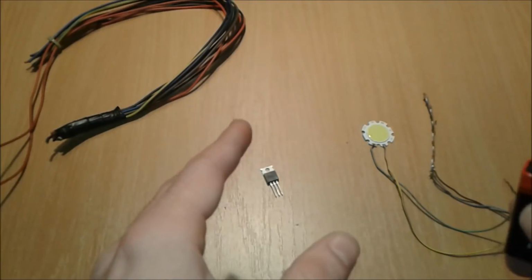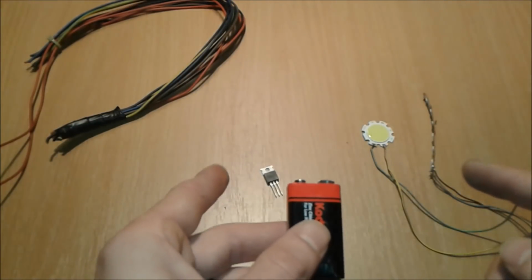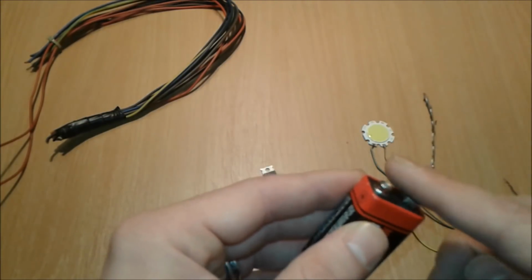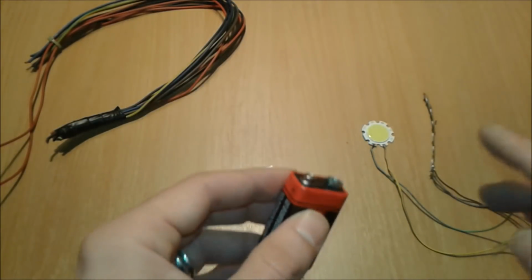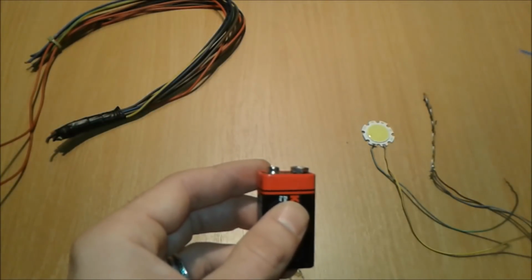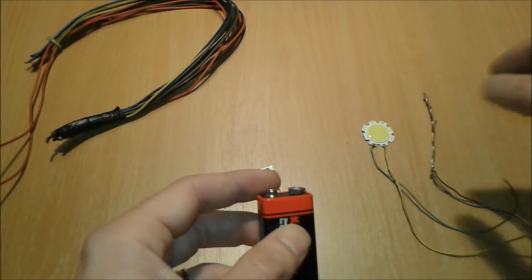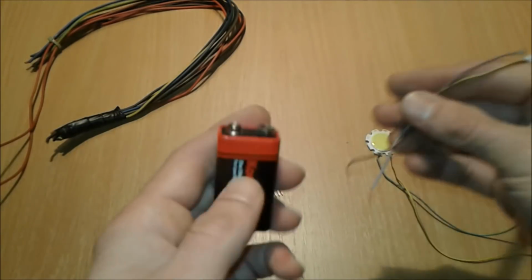First things first, you have to test your power source and your load before you connect them to the touch switch, because this circuit is not about regulating the power supply or adjusting the power to the load. No, this is just a project regarding a MOSFET that is going to replace the switch with a touch switch. Alright, so we're going to choose this one first to test the load.